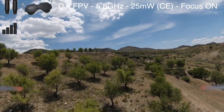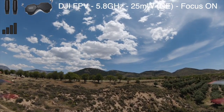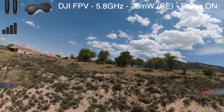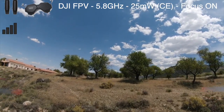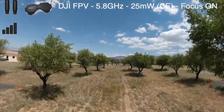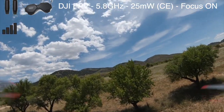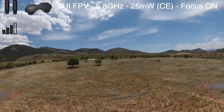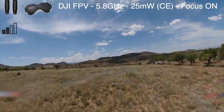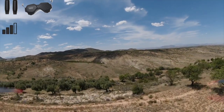Coming up to the trees and going behind them — the patch antennas are pointing in exactly the wrong direction at this point, but we're only out to about 60 meters. Flying through fast to get past — no real signal degradation. Up over the tree — let's see if we get our telltale dropout behind it. Okay, that definitely breaks up and it was a bit worse than the stock antennas, but considering it's a directional antenna that's pretty good actually — very usable.